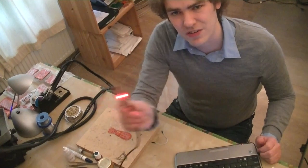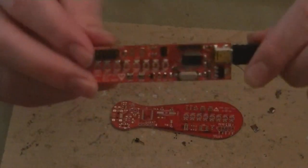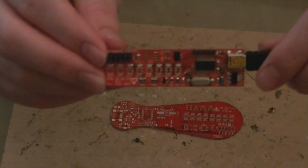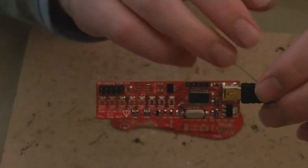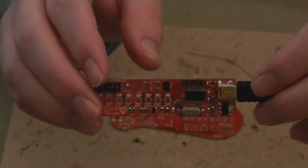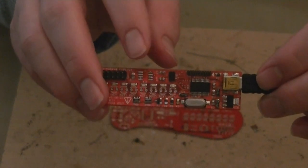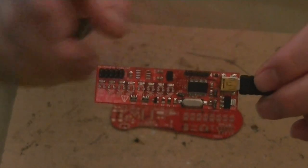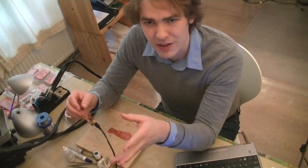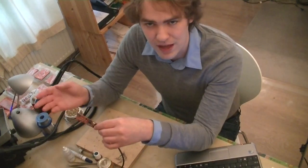So this is the best example so far — it's supposed to say 'hello world,' but it's going to need quite a bit of tweaking to get the timing exactly right and to clean up the accelerometer data. This is the basic POV toy hardware, the version one prototype we've been working with. It's got a PIC chip that does USB communication, so when you want new patterns or words programmed into the POV toy, you upload them over USB. They're stored in an EEPROM chip, a memory chip that will go here — I haven't populated it yet. This is different from a lot of POV devices where you have to compile in the different words or program it directly to get new patterns in. Here you just upload it over the USB connection with a simple app that we'll write.